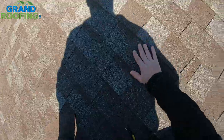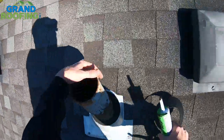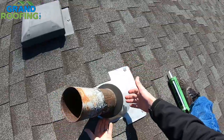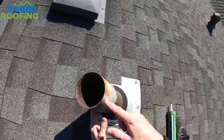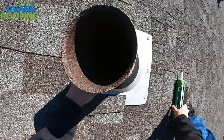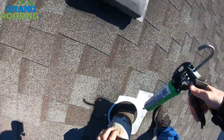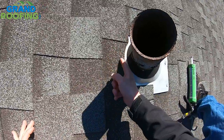This will hold up for quite a few years — probably last long enough until the roof's ready to be replaced. That's going to be super simple and easy for you guys to do as opposed to completely tearing out around the shingles and replacing it. Same thing for this second one. If you want to replace it fully, depending on your region, you can put a lead pipe boot on. Some cautions: they only make lead boots so high, so if the pipe is too high you might need to cut it — and if it's cast iron, careful, it can crack and shatter. In my area I'm not a fan of lead boots because squirrels chew through them, and they're a bit more pricey. We're going to add just a little bit of caulk around the backside again. Use your own determination whether you need to caulk the backsides or the whole thing. The point is the pipe boot itself is good — no bad installation error with the shingles.